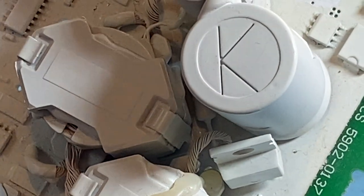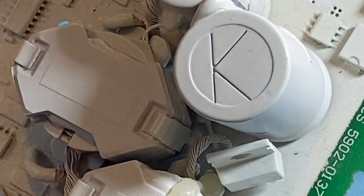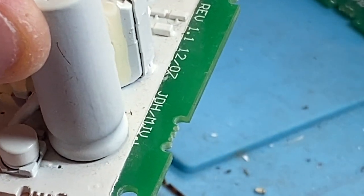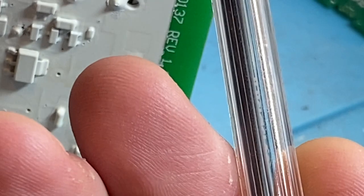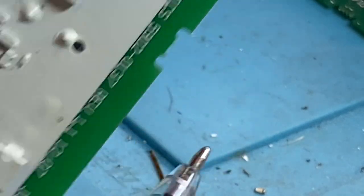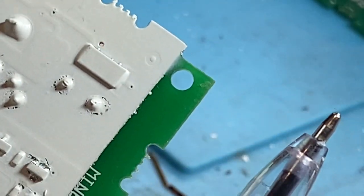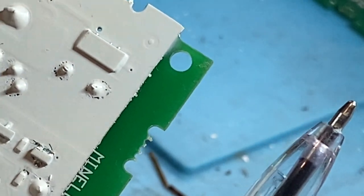And if you have a detector and you have it come off a quad bike and it doesn't turn on afterwards, well, things you'd want to look for is these capacitors. Because of their mass, they can actually come loose, and the soldered pins here, this is still soldered on this one. I have to get this down because I'm so zoomed in. But what actually happens on these, there we go. You can see these, if a capacitor moved left and right, and you can see the leg through the solder there moving, that would probably be the cause of failure.